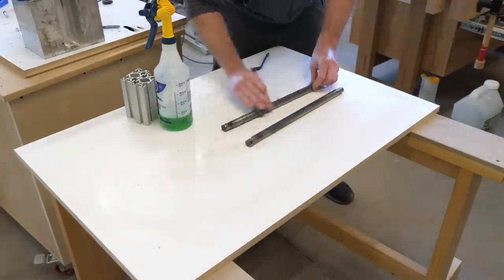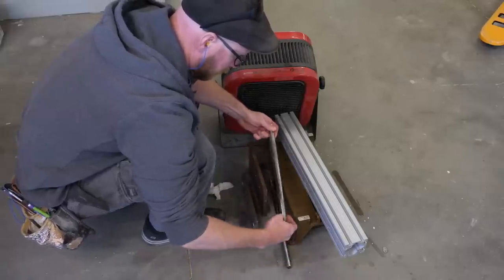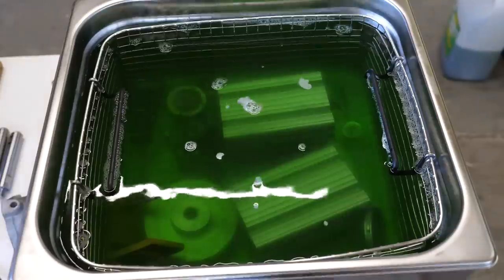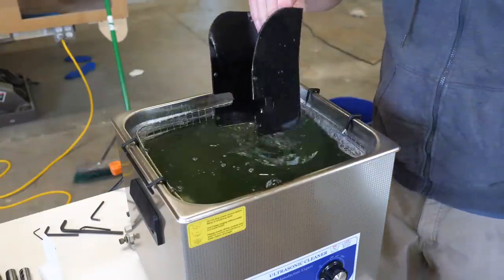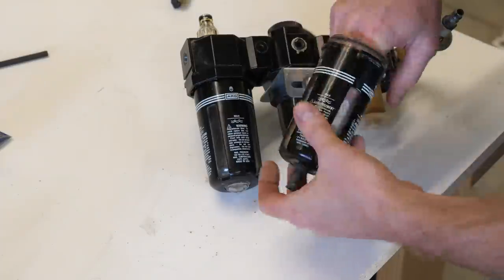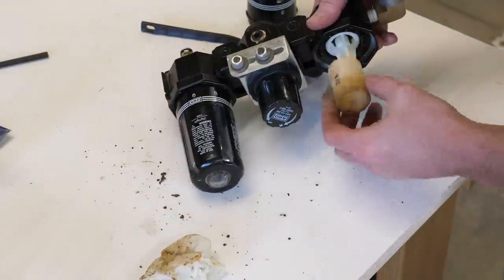On to the cleaning phase. Some parts I wash by hand with Simple Green and rinse with water, then place in front of my industrial-strength hair dryer, which I can't live without. Anything that fits gets run through the ultrasonic cleaner. I clean out the pneumatic stuff as well — this is a water separator filter thingy and also an oiler. This was a crusty mess and I don't think oil had ever been added to it.